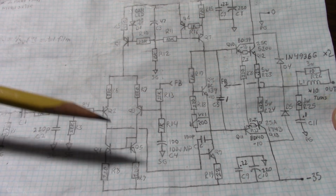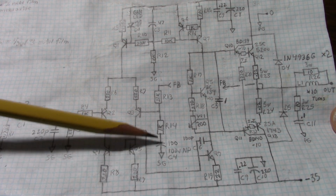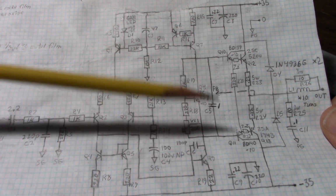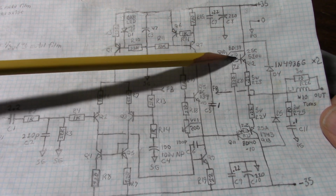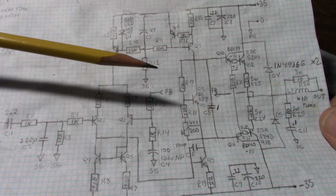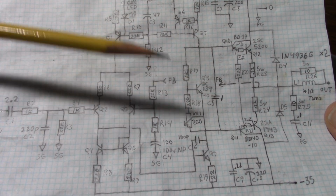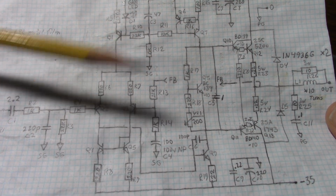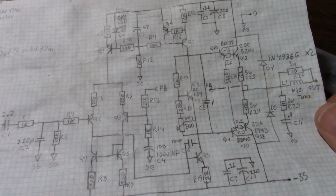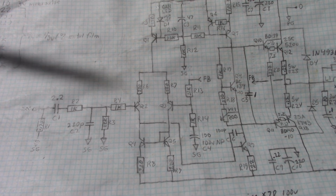Why doesn't it happen with an AC signal? Because with the changing voltage across this capacitor, the capacitor's going to conduct that current. It's never going to allow that to reach a high level. And that's one issue with these amplifiers, where they're pretty much DC coupled throughout. If the output transistor shorts and pulls the output to one of the supply rails, it could cause damage upstream. It could cause high current to flow from a previous stage, or it can cause reverse bias across an electrolytic capacitor or a transistor. But like I say, in normal operating condition, including clipping with this amplifier, I don't foresee any such issue arising. Never remove this capacitor here. Always feed it an AC signal.